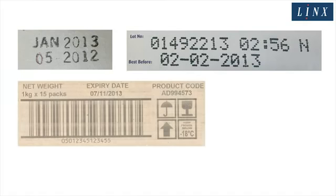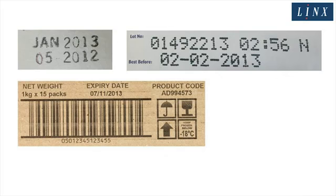Valvejet coders are known for their limited operational time before repair is needed and more commonly their leaks, wasting ink and causing a mess in the workplace. Their low resolution makes them no use for barcodes and graphics. Piezo coders are also known for their mess and lack of startup reliability. Thermal inkjet, whilst known as a clean technology, does suffer from reliability issues when you stop and start printing, especially with faster drying inks.